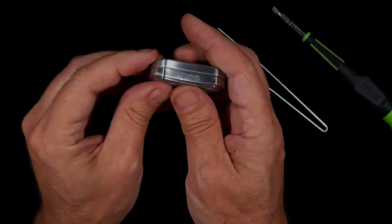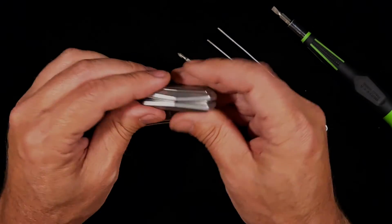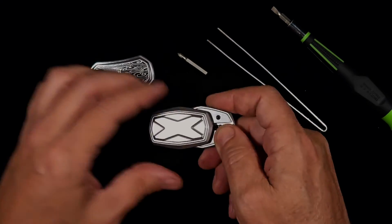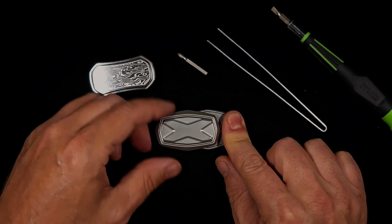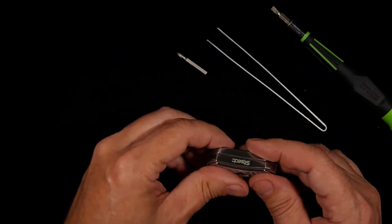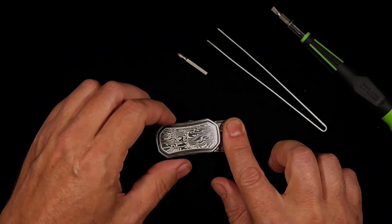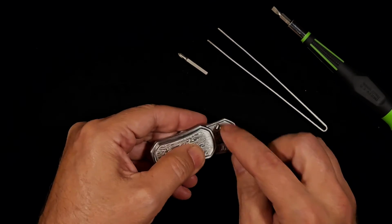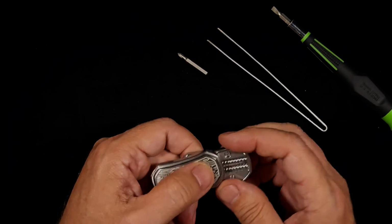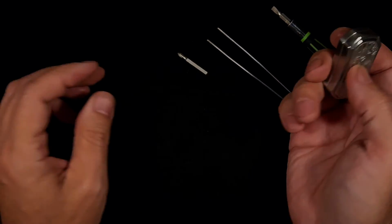now without the Teflon tape, which was located here, covering up the screws. It becomes a little bit more sloppy here. Where's the Chenyu at? The Chenyu is a little bit guilty of that too. But overall, when this is fully extended, let me hold it down on the table here, there's very little play. Let's try that with this one once. See what I mean? So, if these two plates were a little bit closer together, or if that post that runs up into there was a bit fatter, wouldn't have that. But I'm going to keep it like that. I want to keep an eye on these screws and see if they come loose.